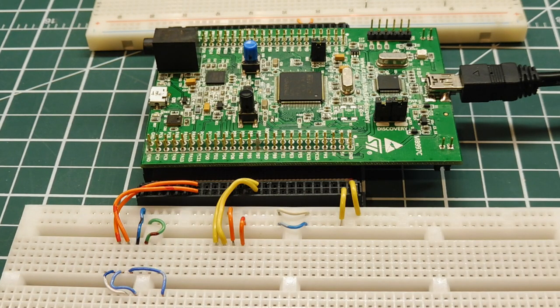The last way is to use the USB connector on the bottom of the board and use DFU — Device Firmware Upgrade — which uses USB to upload the hex file into the microcontroller. To do this we have to convert the hex file into a DFU file, then run special software to upload it. So there are three ways to upload firmware into the STM32 ARM microcontroller, and we'll look at all three.